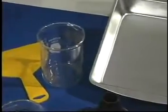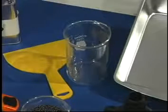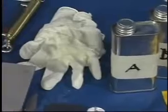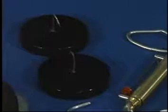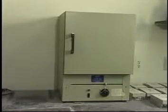a minimum 400 milliliter beaker, a minimum 6-inch long rigid straight edge used as a screed, 2-component urethane adhesive, rubber gloves, a spring scale having a hook attachment and a capacity ranging from 26 to 66 pounds and an accuracy of 1/4 pound, jar caps that are between 2 inches and 3¼ inches in diameter with a depth of approximately 1/2 inch with hooks, a drying oven capable of maintaining 109 degrees Fahrenheit at no more than 60% relative humidity.